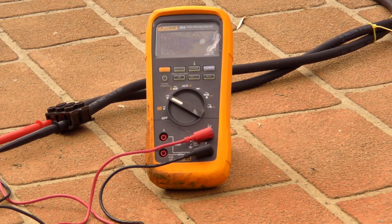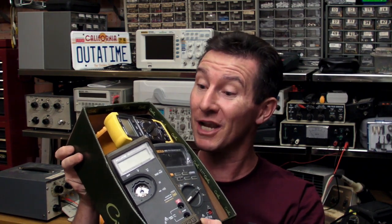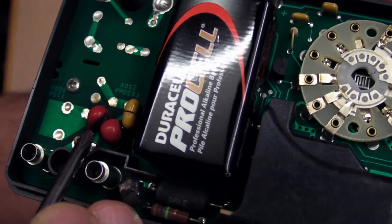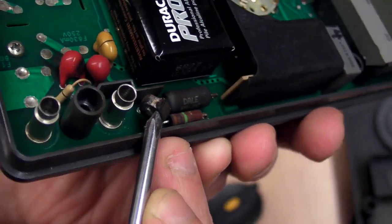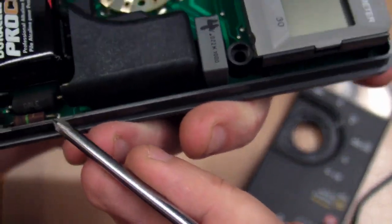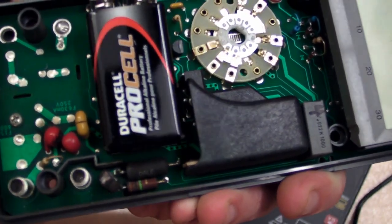We're back in the lab and I've got a box full of busted meters. You can still smell them. Here's the original Fluke 70 series from the 1980s. These aren't CAT-rated input protectors, so they're a very old design. As you can see the MOV down here — the Metal Oxide Varistor — which is used for the input protection, they're just blowing to kingdom come. And that's what generated all the internal pressure, enough to actually blow the knob clean off. But there's really no other damage — it's just taken out the protection devices, exactly what they're designed to do.